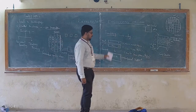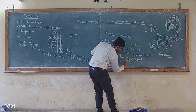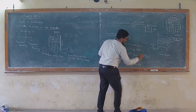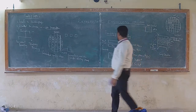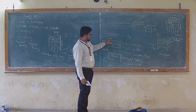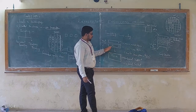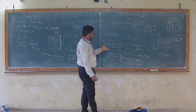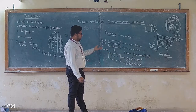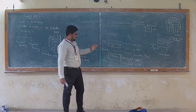So this gives mechanical support, or electrical support, or it can be electrical contact, right? The die factors may provide some electrical contact too. So I need bonding because my layers are very thin in nature, and very thin layers could be very flexible. They could convert from stable into unstable by means of mechanical cracking, some instability. So it may affect the physical, mechanical, electrical, chemical properties of the die. So I need some support called a thick die.